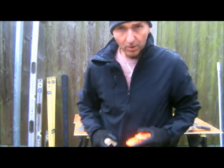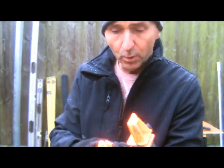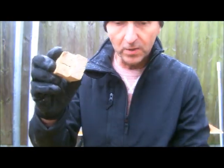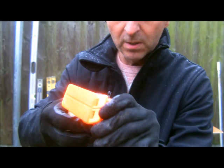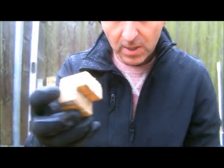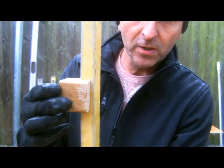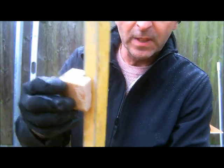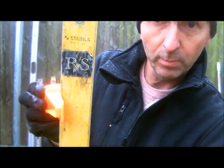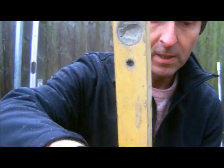When we come to corner blocks, we have the normal corner blocks just for brickwork — you can see those on the porch cavity walls video. I also like these little wooden ones with quite a large return. I specifically made these — I call them my profile blocks. If I use a straight edge, the line fits nicely onto it and stays tight. If you use something bigger the line can pull the block and won't be true, so I have four of these specifically for when I use my profiles.